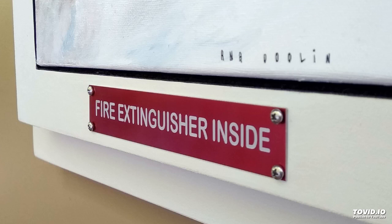The next thing we'll do is check both sides and make sure that the drywall is trimmed even with the stud on both sides, so that we will have that 14.5-inch opening that we will require. Now, the top and bottom cuts don't have to be pretty. Remember, the frame itself covers almost 2 inches all the way around. So even if it's not the most beautiful hole you've ever seen, it doesn't matter. The frame itself will cover any imperfections and make everything look beautiful.